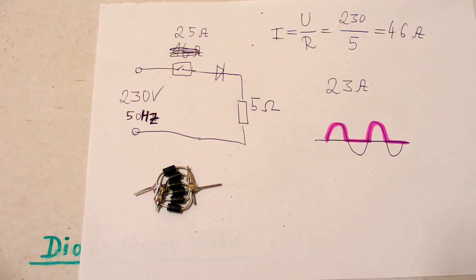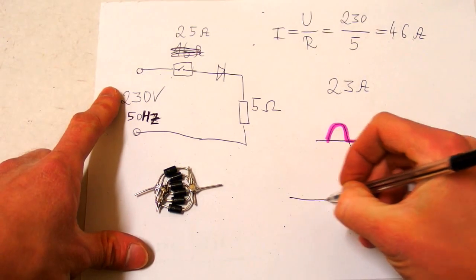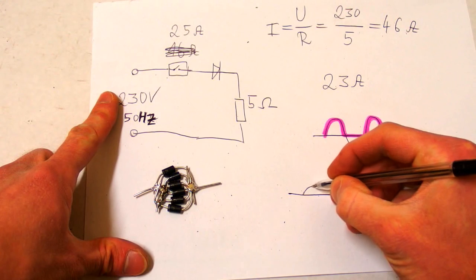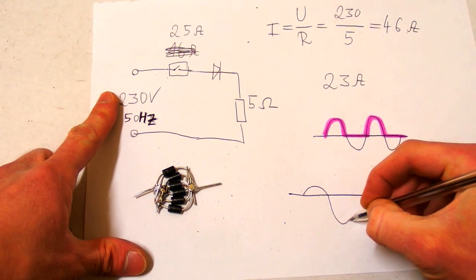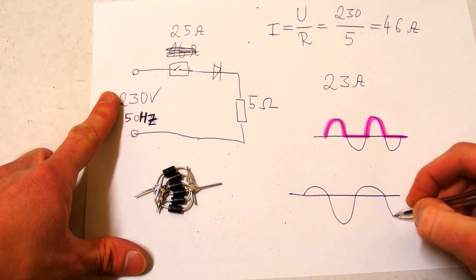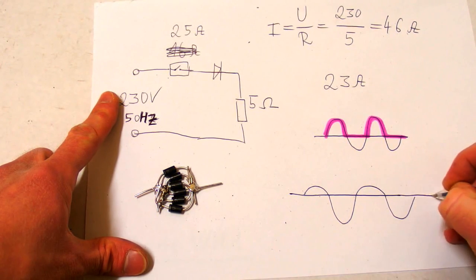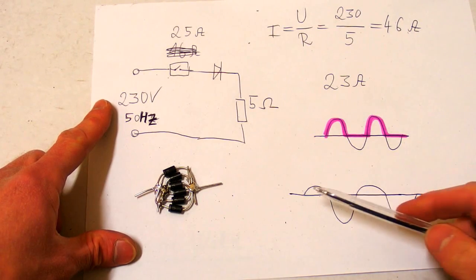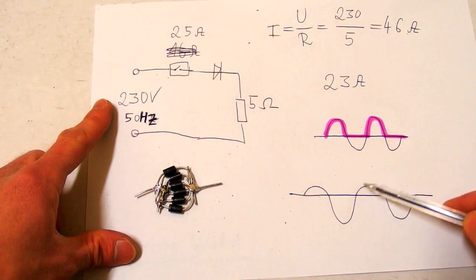And when I connected it to the mains, all the lights in my house were flickering because it was only loading the mains in 1/2 cycle, and so the 1/2 cycle was loaded and the voltage dropped in this half cycle, and the other half cycle wasn't loaded, so the voltage didn't drop. So the mains voltage at the time looked like this.